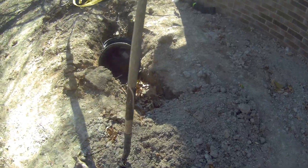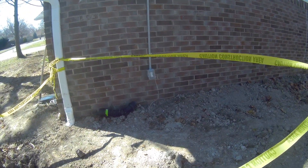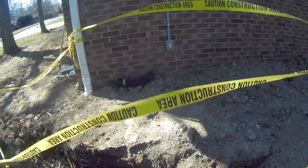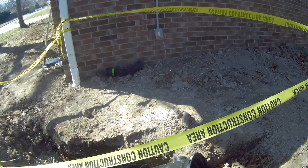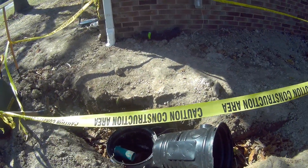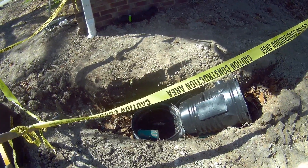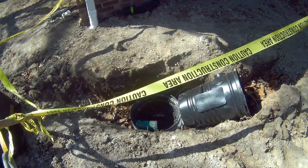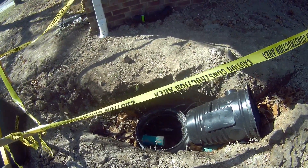Another quick tip relates to your sump pump and the electrical outlet that you connect it to. There are two important things: one, you do not want to run a sump pump on an extension cord; and two, you don't want to plug a sump pump into an outlet shared with other electrical appliances. You need a dedicated outlet for your sump pump. The reason is that your sump pump will receive low voltage, and then it has to draw more amps to run, which causes the sump pump to run hotter and can cause it to fail prematurely.